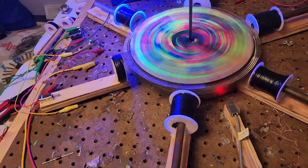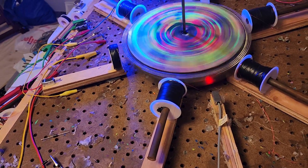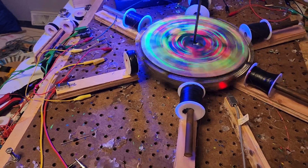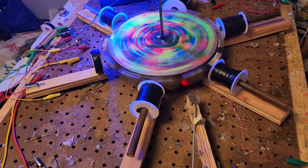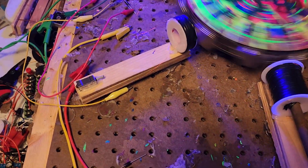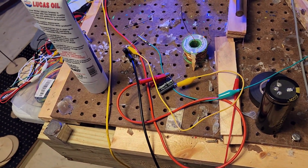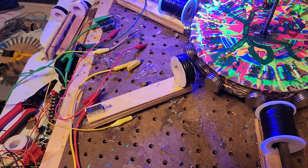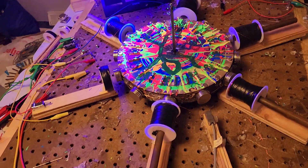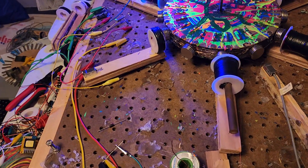Yeah, look at that — wow! That didn't take 15 seconds to get to the point where the magnets are about to come off. It took a lot longer last time, actually. And we've got this one kind of out-of-the-way coil over here that doesn't generate much — that's another thing slowing everything down. So we need a bridge rectifier and a larger coil, maybe even one with a core in it. If I could get two with cores, that'd be great — I might buy some core tonight.